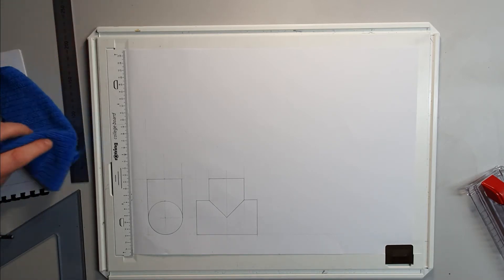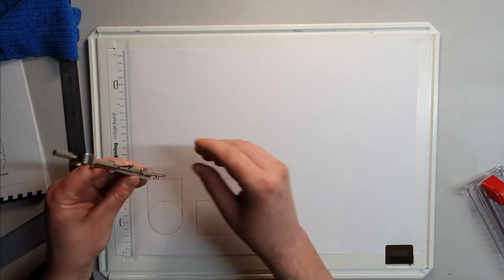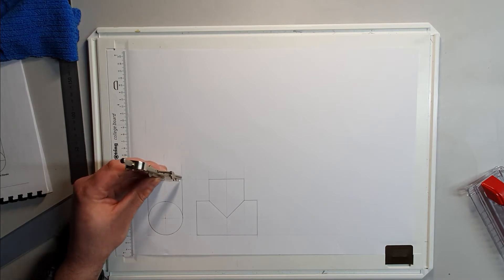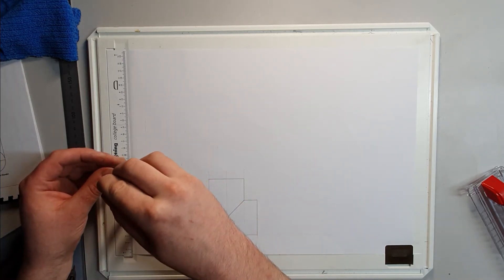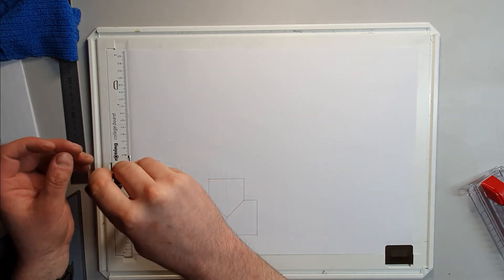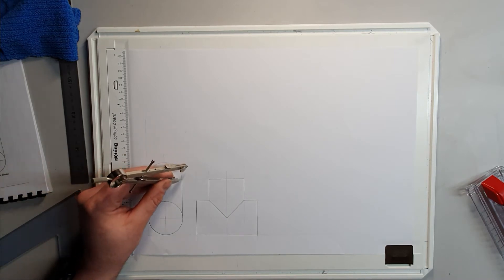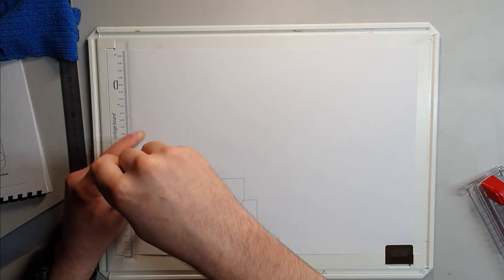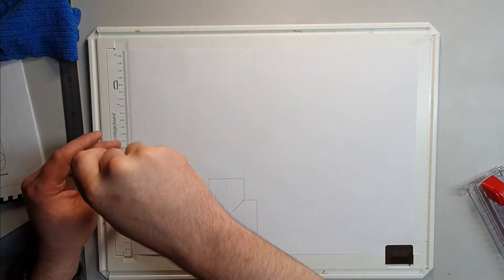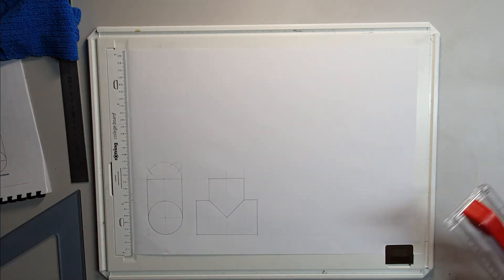You can see our two views there. Now I've got to put some marks in here. With sheet metal, you've got to divide it up to get reference points so you can make a nice pattern. It happens that if you arc the circle from the edge and the other edge, and from the center, you divide the circle into 12 — so that's half the circle, six segments there. Let's draw these lines down.